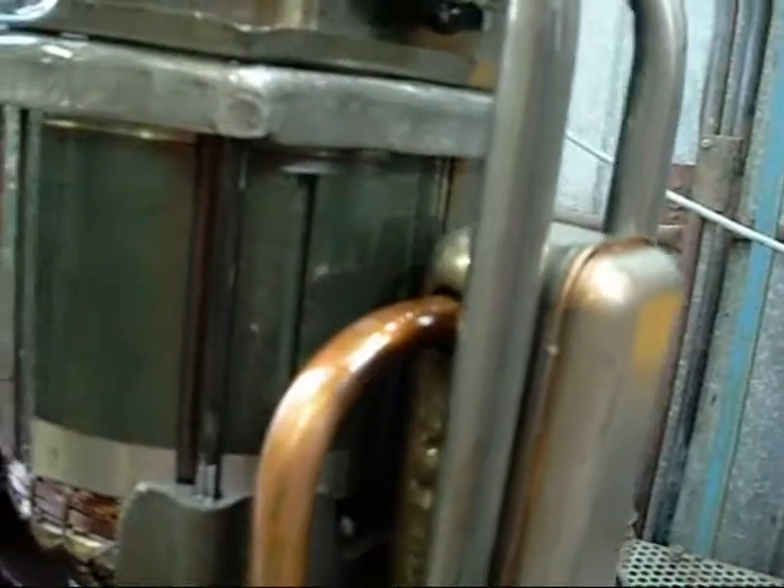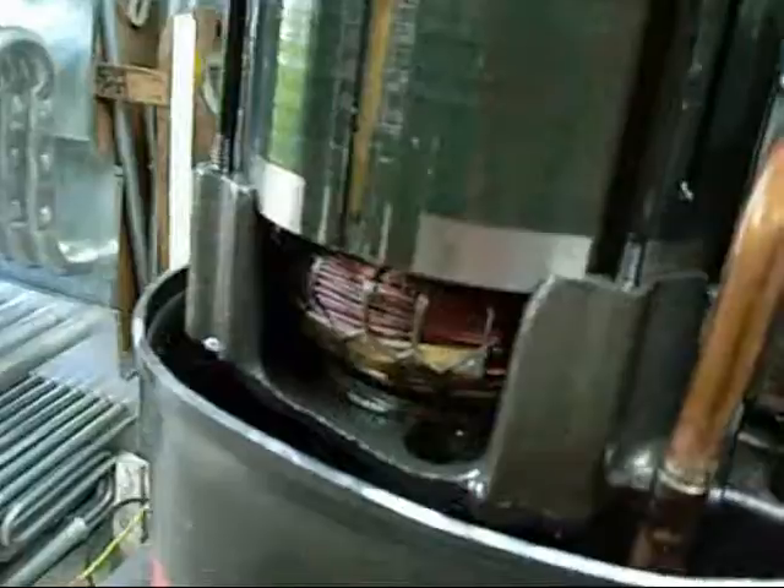That's why this one failed — nothing else wrong with it. Just over time, vibration has cracked that out. Looks like it's been like that for a while. It might have broken when they dumped the machine on its side at the depot, but it seems like the kind of thing that would have broken from years of vibration. That's why this one was turfed. You can see the inside of the crankcase — there's a lot of sooty stuff. It's just pumped high temperature gas all around the inside and made things worse for itself.